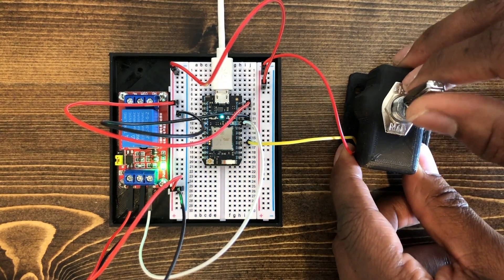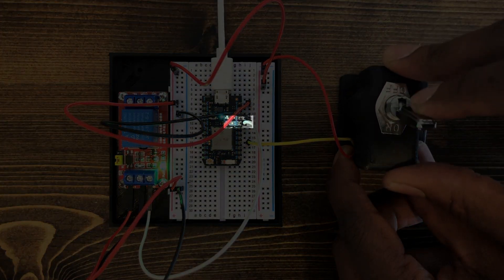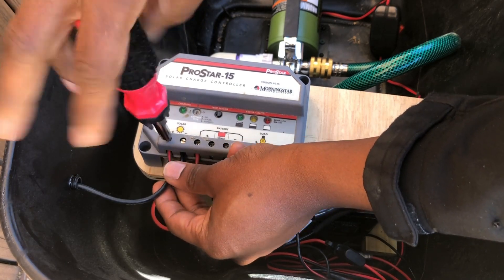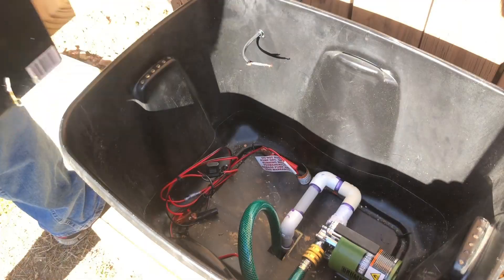As you can see, when I flip the switch to the on position, the D7 pin receives power, which means my pump should turn on. Next, it was time to finally go outside and start prepping the new home for these electrical components. I first needed to disconnect the solar panel from my solar charge controller and then remove the electrical components and mount from the container.